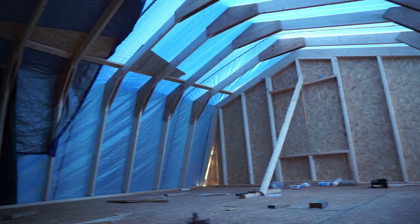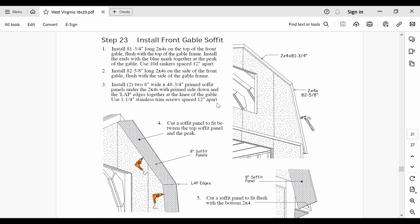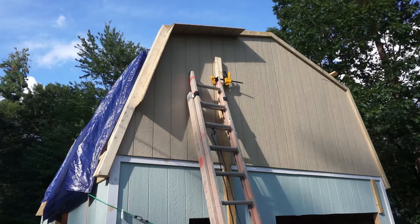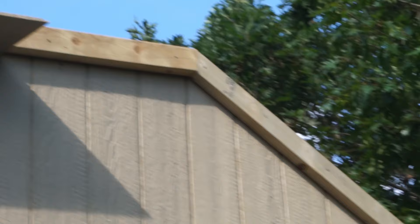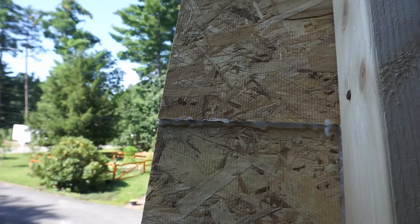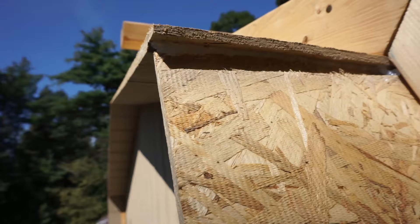Once the glue was dry I installed the trusses according to step 21. First I put the 2x6 hangers in place on the truss plates with only a single nail so they could still pivot, then slid the truss in place and nailed the hangers down. A 2x4 board ran continuously down the length of the garage to add extra support for the front and rear gable walls and trusses. At this point I had to pause building for a few days due to incoming rain, so I covered the whole thing with tarps. I skipped step 22 and went straight into building the soffits for the front and rear gable walls as shown in step 23 — I just wanted a complete roof to keep the rain out.